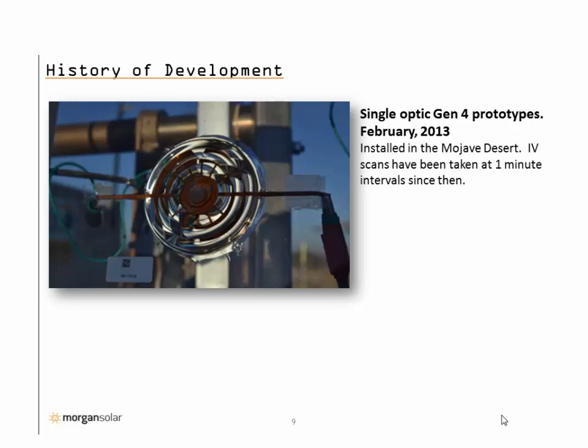we can bring the efficiency up to a very high level, to about 30%, rather than a 16% silicon solar panel. And so that means for the same tracker that we sell to someone, instead of being able to generate 3,700 watts per tracker, they can generate 6,500 watts per tracker. So their wattage output on a per tracker basis is greater. They need less land, fewer trackers, less wires. So we really believe that the CPV is going to enable us to achieve really low cost of electricity, staggeringly low.